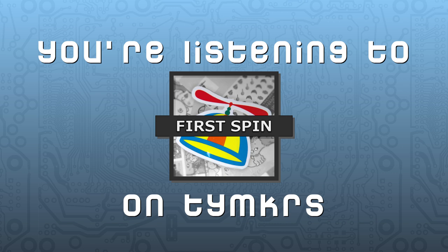SPI is equally straightforward to use as I2C. You talk to devices by sending a command byte then reading or writing. With SPI RAM, you send a read command and read a byte, or use 'read continuous' to read multiple bytes with automatic address incrementing. SPI RAM is handy for the Propeller because it only takes a few pins and you can get 64 or 128 meg RAM chips without using up 18–20 pins as with parallel RAM.